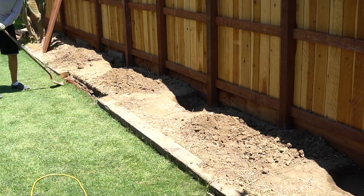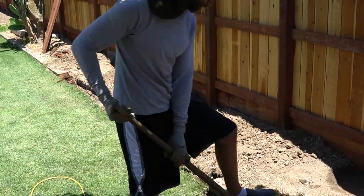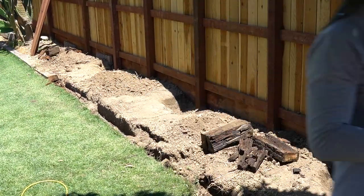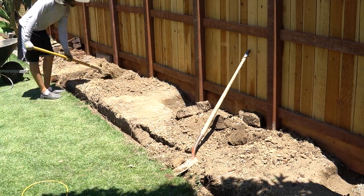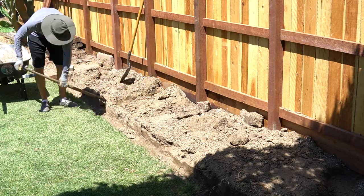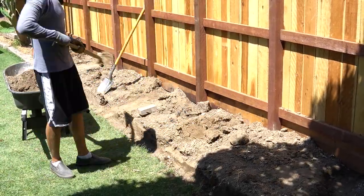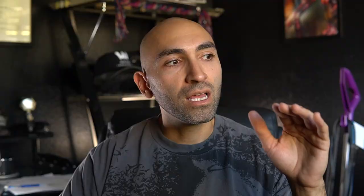Next to my lawn I had giant pieces of wood separating the lawn from the dirt area, so I had to remove those because that's where the pavers were going. They were pretty stubborn to cut and remove, but it did eliminate some of the digging for me. For the pavers, I went down about four inches — two inches of gravel for drainage, then about an inch of sand, followed by the pavers on top. That made the pavers pretty level with the lawn, though one spot ended up slightly low.